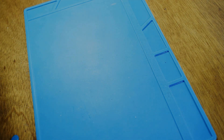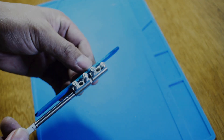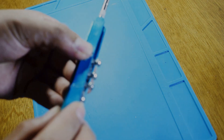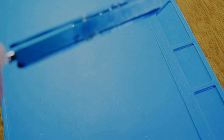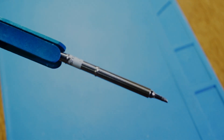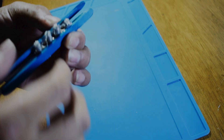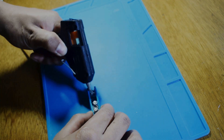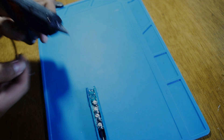In building the handle, we will use the glue gun. We will stick the popsicle stick to the connector. Make sure not to put excess hot glue on the soldering iron tip because you will lose the easy tip change functionality. And to add more strength, I have poured a lot of hot glue at the other end of the handle and covered it again with popsicle stick.